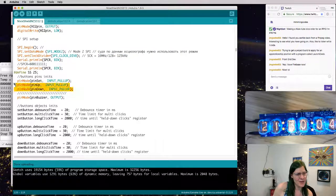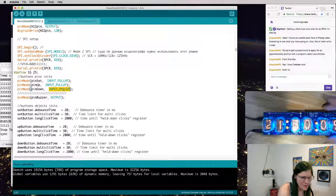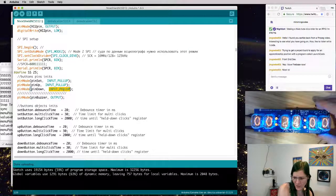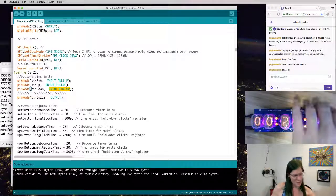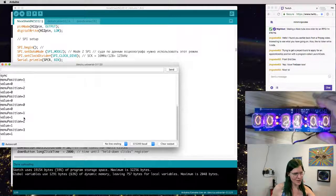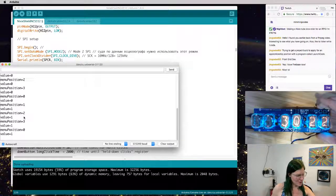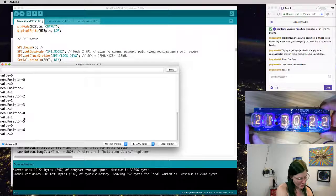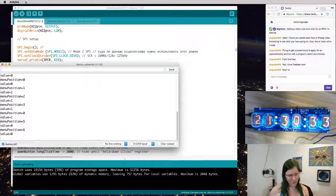And set up and down, it's turning on the pull-up resistors, which I'm assuming is for the 3 buttons along the top up here, for setting the mode of the clock and setting numbers up and down. So I'm assuming those functions correspond to these things. Hey, we can actually see it pressing. Oh, and it has a setting mode. It can blink the numbers. That's pretty cool. And while you're in setting mode, it takes those through a little cycle too.